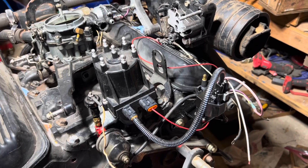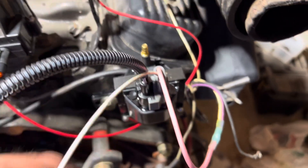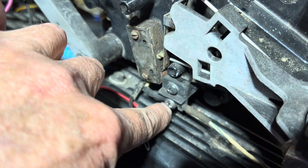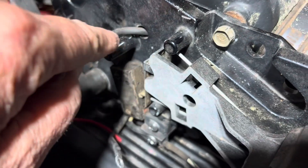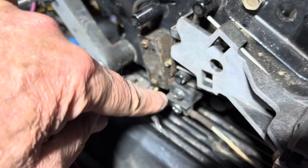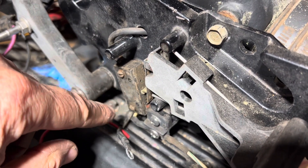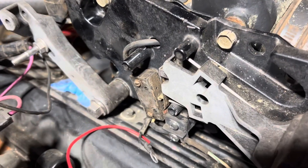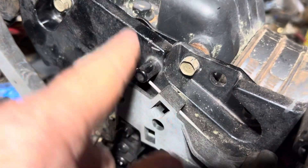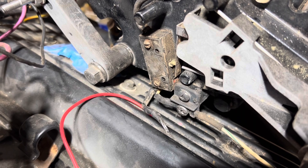I've not completed this but I'll describe what I've done so far. The white with green stripe was landing here and also going toward the shift kill, so I landed it on the bottom screw of the terminal block, matching it up with the white green on the bottom side. That wire continues out and goes to the top of the shift kill switch. Here's where it gets tricky: you cannot land any wire on the upper terminal because that screw is screwed into the metal housing, which grounds it. If you put 12 volts on that terminal you'll have a direct short, melt your wires, or blow your fuse.